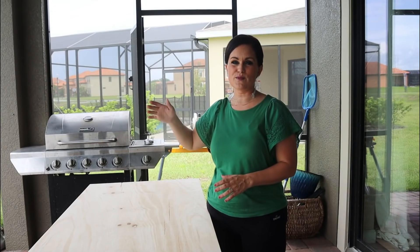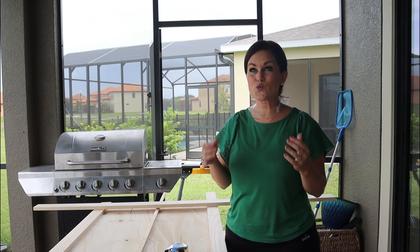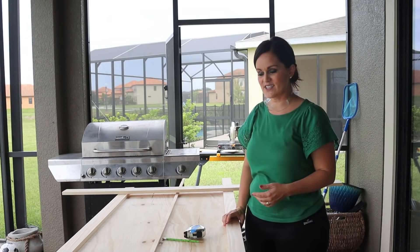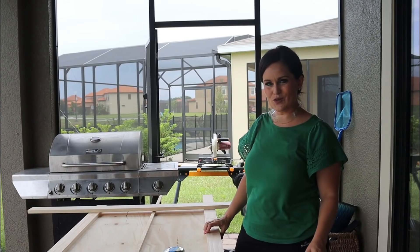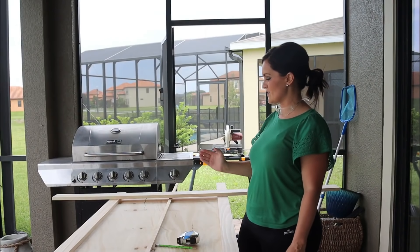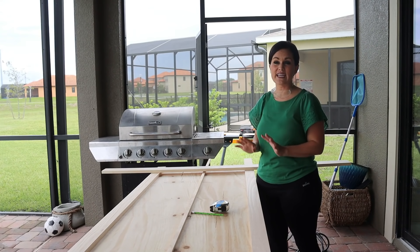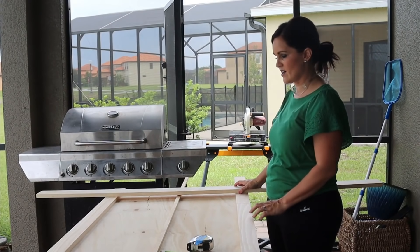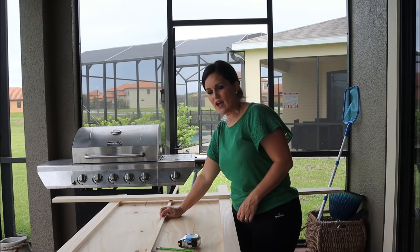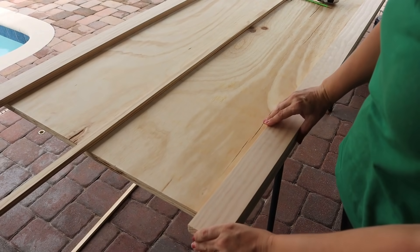Industrial mirrors are such a rage right now on TikTok and YouTube. I would really love to build one of those massive industrial mirrors, but I don't really have a spot for it, so this is my little compromise. We are going to be building a grid — just so you know what things are called: the ones that run vertically are called stiles, and the ones that run horizontally are called rails. We're going to start making some cuts and lay it out before ever gluing or nailing anything. We're using one-by-threes for the stiles, a one-by-four for the top and bottom, and three-quarter-inch wide by half-inch trim for the grid.